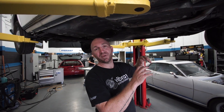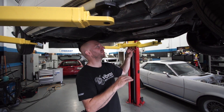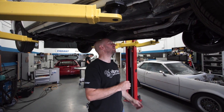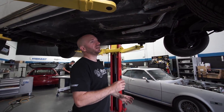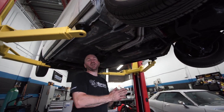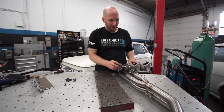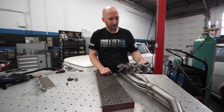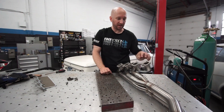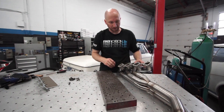So I've tack welded and reshaped my runners to fit my head flange. I just wanted to make sure that everything fits back together in the car properly and I've got good clearances everywhere. Now I'm going to take it all back out, finish welding my head flange and then move on from there. So now I've got all my tubing match ported to the shape of my exhaust ports on my head flange, tacked welded in place. I'm ready to weld my head flange to this tubing.